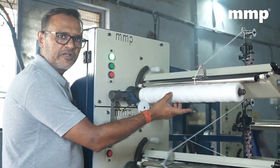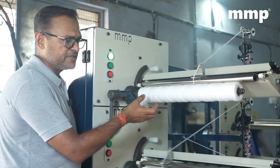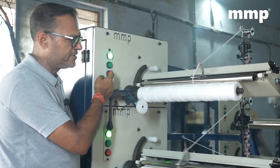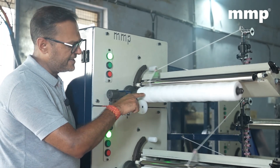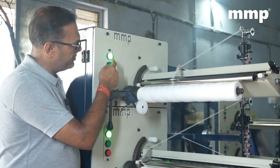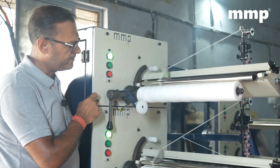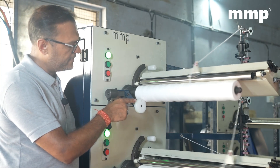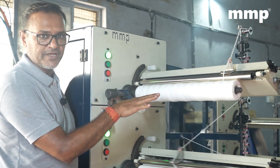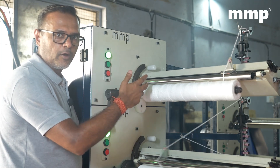To ensure that the diameter of the filter cartridge has been achieved, we have a sensor over here. The sensor monitors the diameter of the cartridge and one has to set this manually. I'll start the machine and show you how this operation happens. The production has started. As soon as the cartridge reaches and touches the sensor, automatically the red light will be on. It's just touched — this sensor has triggered and the machine has stopped. This signal only shows that the machine is ready for the second operation.